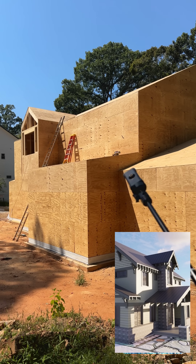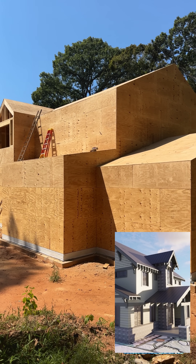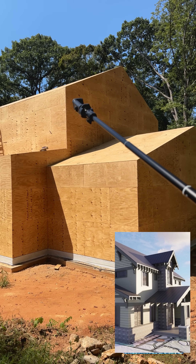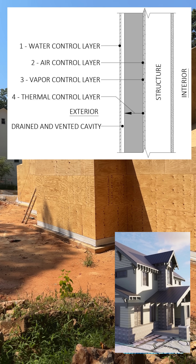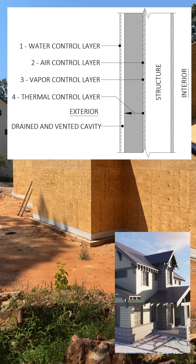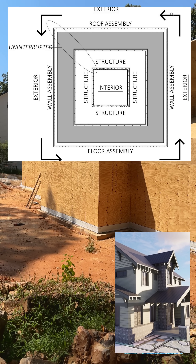The overhang — we are installing 4x8 heavy timber rafters on the outside of the structure, and this is to minimize or eliminate thermal bridging. We're not letting the roof structure itself penetrate through the sheathing, because that's where our control layers are. Our air, vapor, water, and heat control layers are all right at the sheathing layer, and so we want to protect that — we want it to be super continuous, uninterrupted.